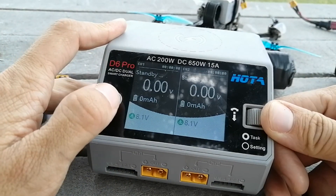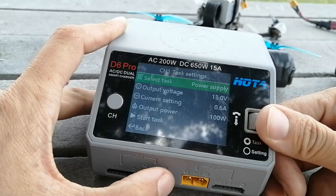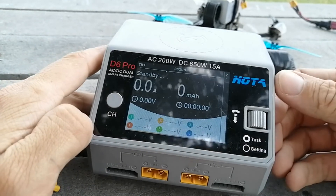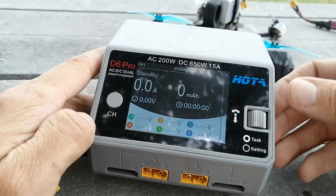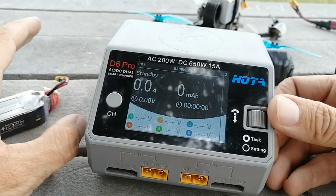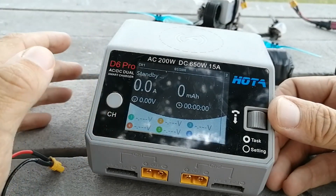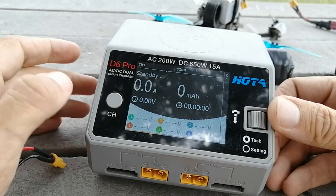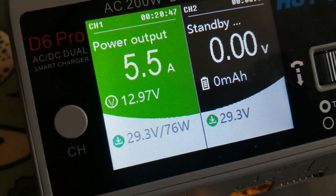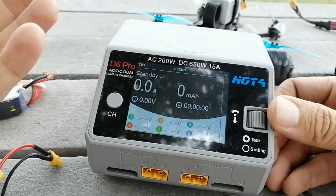One of my favorite additional features: you can select a channel, choose the power supply task, and set an output voltage and maximum current or power — then use this thing as a regular DC power supply. That makes more sense when powering it off mains, not a battery. It's not fine-grain control but you could use it for debugging quads on the bench, powering a DC soldering iron, or testing devices. I used it to test an inflatable mattress pump when camping.